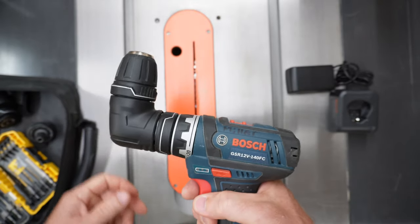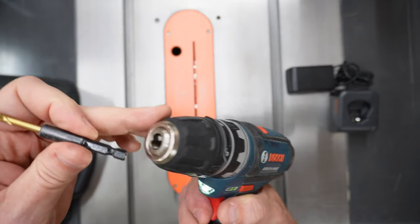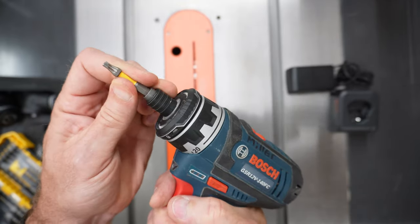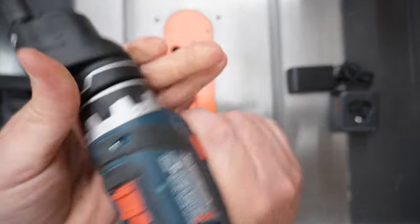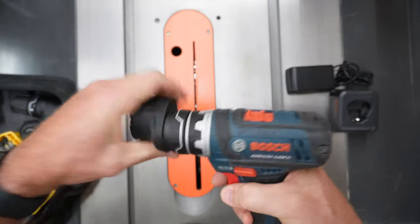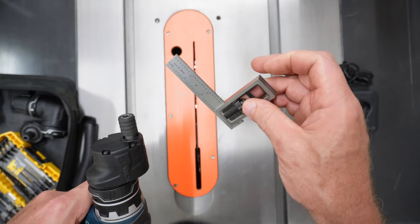The second function is a keyless chuck with a 3/8-inch chuck, so it will cover most light to medium duty drilling tasks. It has nice deep grooves in the sleeve of the chuck, so it's easy to get a good grip on it to tighten it down on your bit. The third attachment is a low profile locking hex bit holder that slides back so you can insert your bit and then release it to lock the bit into place. The fourth attachment is arguably the one that makes this tool the greatest value — the offset angle attachment. That allows you to get very close to the edge and still drive or drill straight in. This head can also be set to 16 different positions to help you get into very tight corners. The center of the bit holder actually gets within about half an inch of the adjacent surface, compared to over an inch for most other models.